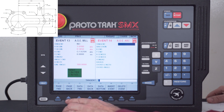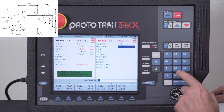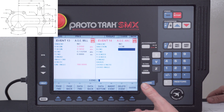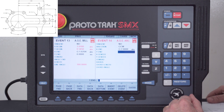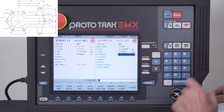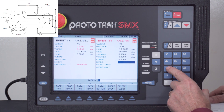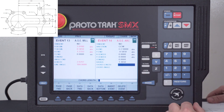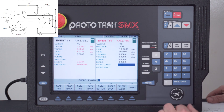Next I need to add an arc. It's not tangent to the line, and its direction is counterclockwise, so I push two. The X end goes right back to where I started — I'll just type approximately two inches absolute to show the other way to use guess. Y is minus 0.585. The center of the arc is 0, 0, there's no corner radius, and the radius is 1.365. At that point it says okay, and everything I didn't explicitly tell it is filled in in red. When I push look, you can see it's starting to look like a keyhole shape.